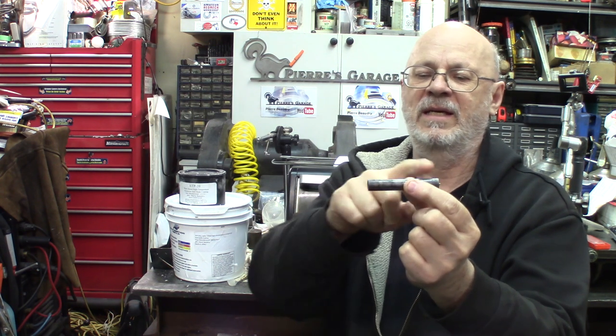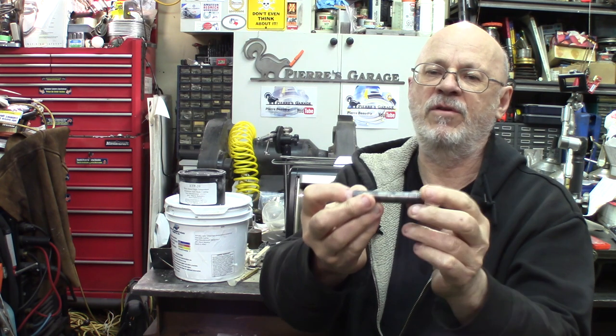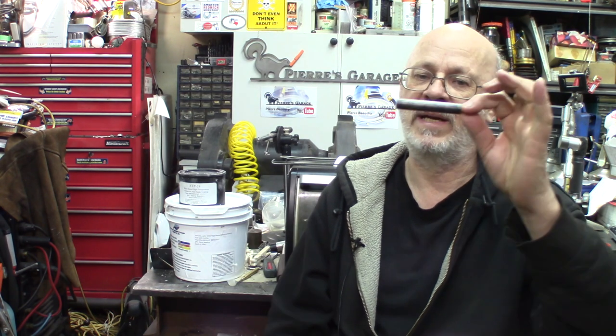If you want to do heat treatment with minimal pitting, there are a few methods. One of the preferred methods would be having an oven or a kiln with inert gas in it. You put in argon or you do it in vacuum. So there's no air, no pitting, no oxidation.